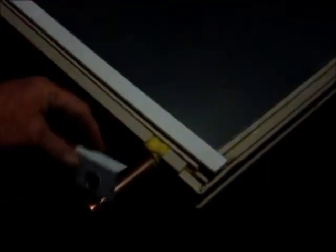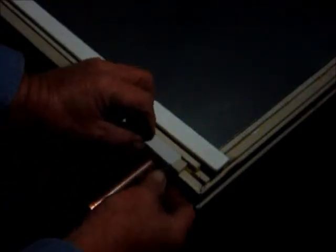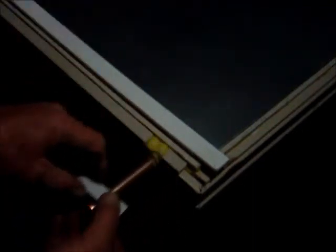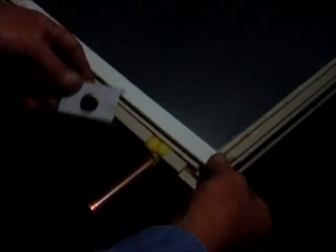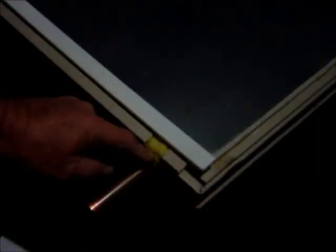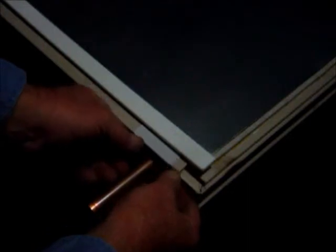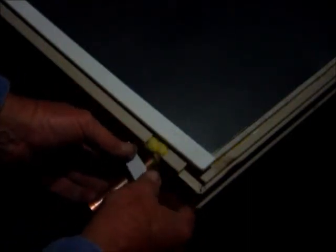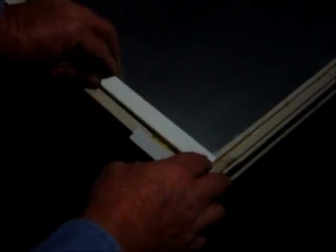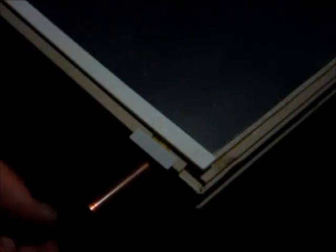This is a corner piece that I made — it fits right over here, and screws here and here. What I'll do is fill this with caulking, slide this over it, and clean up. I'll use latex caulking because it's easy water cleanup. This right here is back at a quarter of an inch, so we'll put a bead of caulking on there, put this down, and stainless steel screws — and that is it. Now this right here is an access for your sensor. I won't really fasten this in and caulk it in until the sensor is installed. So I'm going to go ahead and caulk and put some stainless steel screws in it all the way around and finish it off.